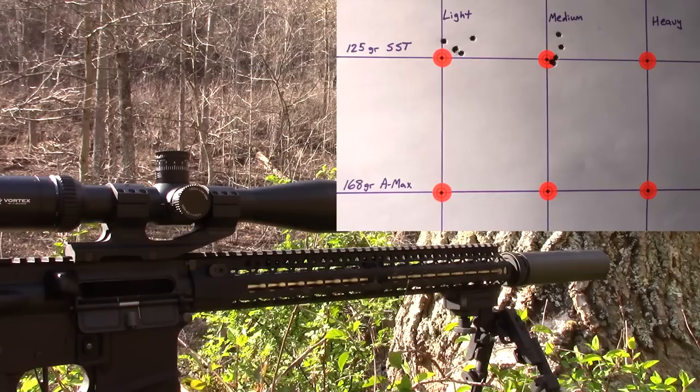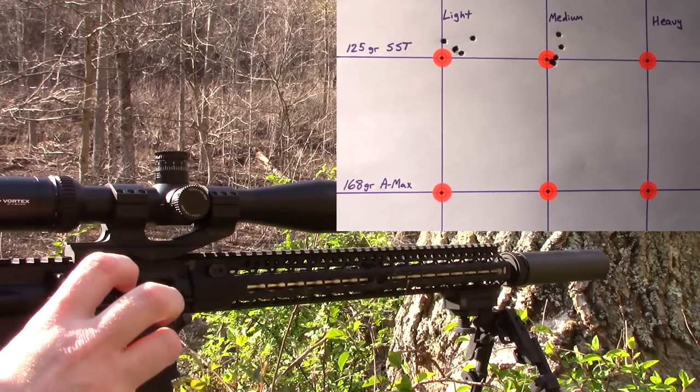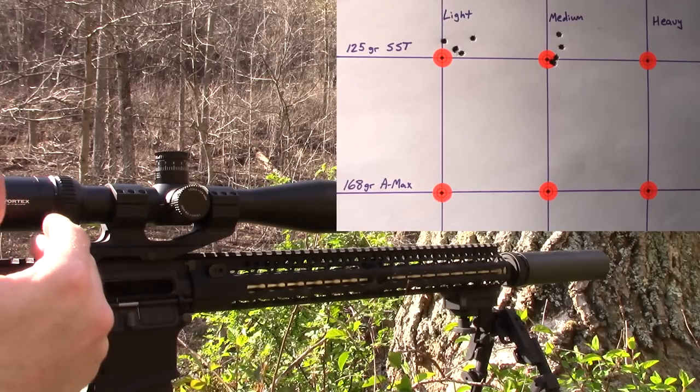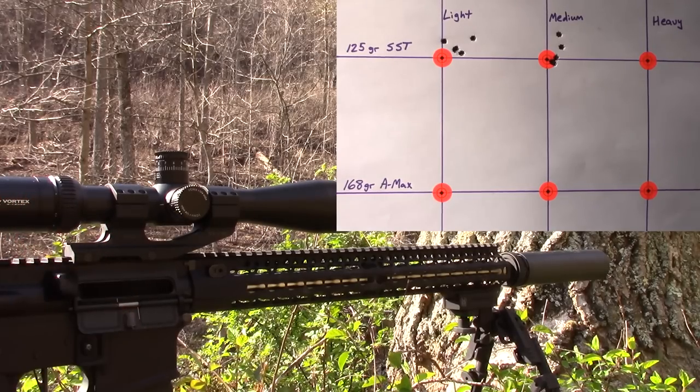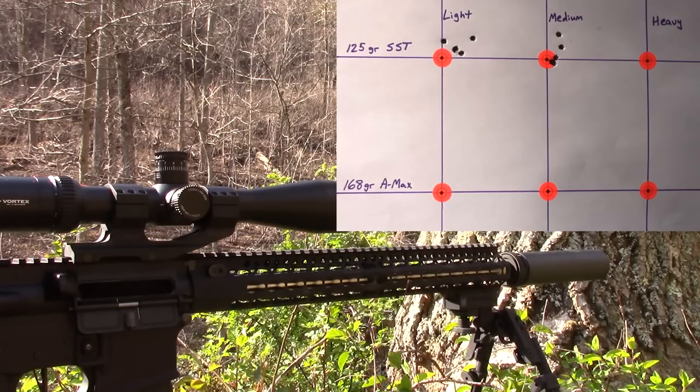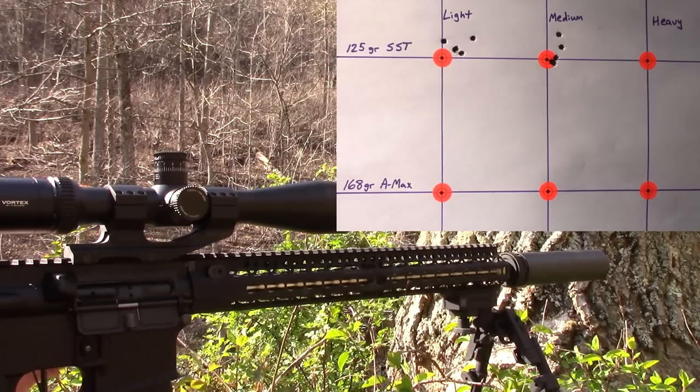You know, I should really be getting velocity readings, but whatever. I'm not in the mood to pull out the chronograph. But that's what some people say, that a good heavy crimp will help stabilize or normalize your starting pressure, because it takes similar force to get the bullet moving every time, so you get more consistent velocities. I don't know, we'll see. Heavy crimp.